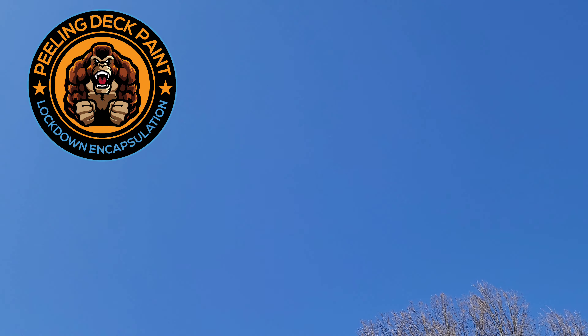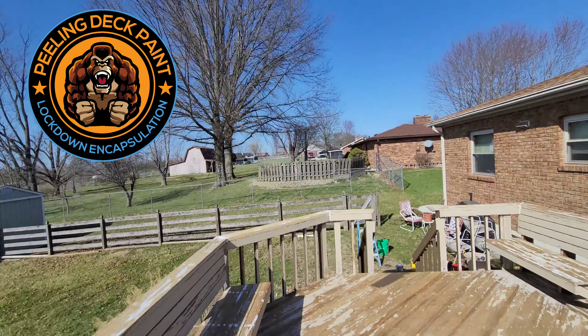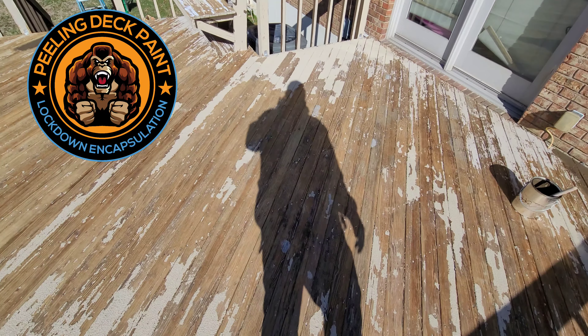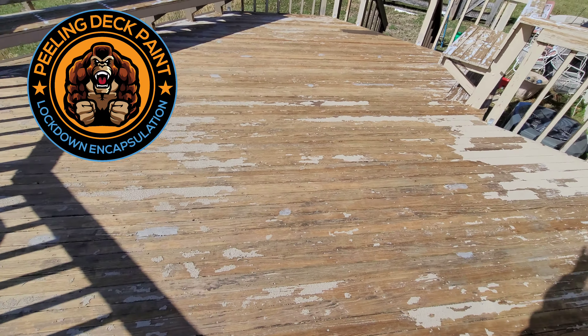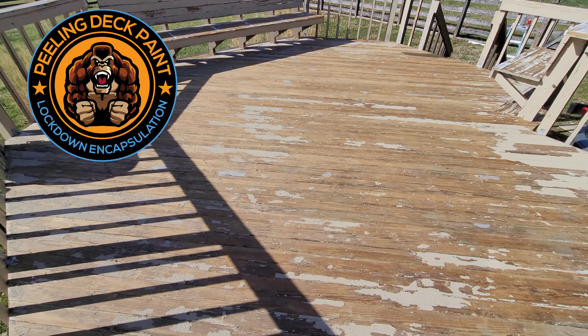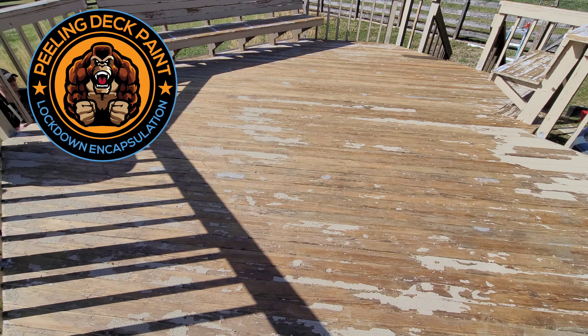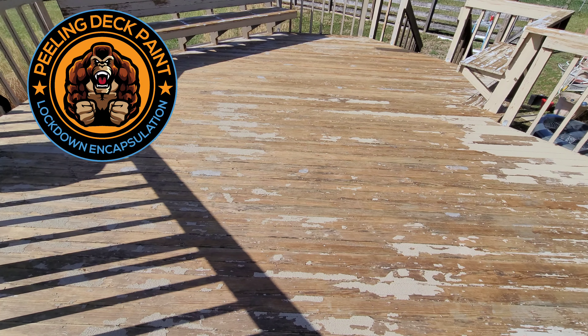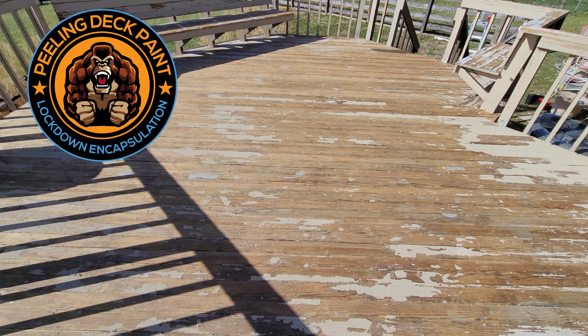It's not super warm — about 50 to 55 degrees — we've let things dry out for a couple days, bluebird skies. We're looking at this peeling Restore 10x system where we've managed to get about 80% off overall: about 95% off the deck floor itself, and off the rails combined probably about 80%.